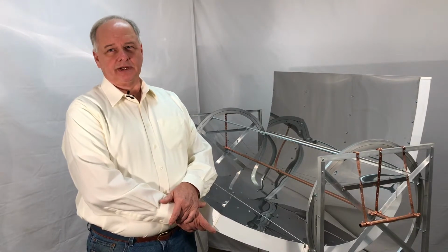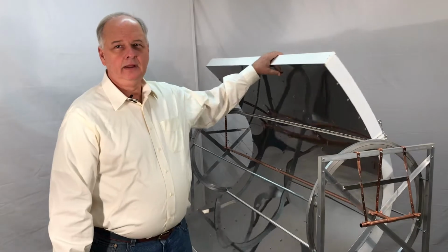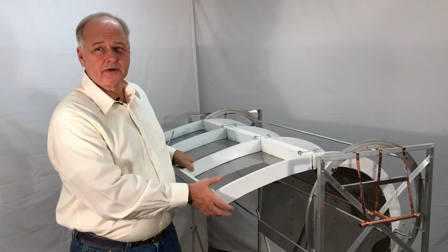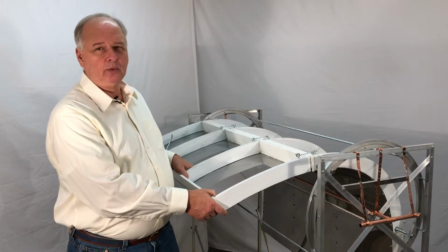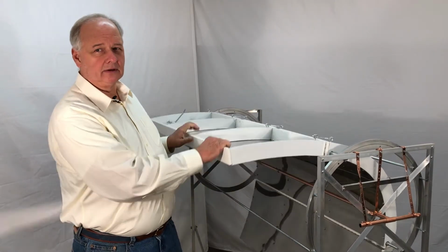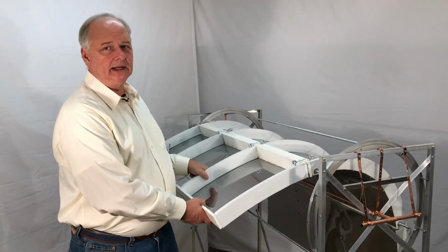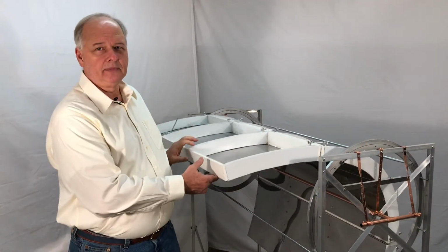Another unique feature of the RingTrough is the ability of the wings to fold inward at night or during inclement weather. Many of the places solar energy is most effective are also the driest and therefore prone to dust. Folding in the wings will protect the RingTrough mirrors and minimize the wind loading during severe windstorms. The rotation of the device itself will act as the mechanism to fold and unfold the wings.